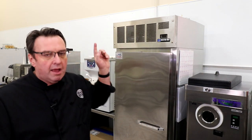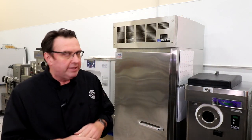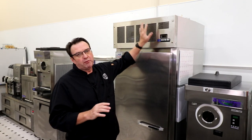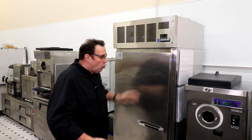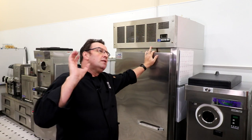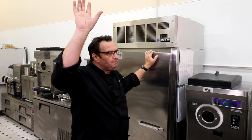This is a Masterbuilt IHC 27 single-door blast freezer. It's not on because it would be too noisy. It's a single-door blast freezer — you can get them with the refrigeration system on top or on the bottom. It doesn't really matter from a sound standpoint, but from an exhaust air standpoint, I prefer my refrigeration system to be on top.